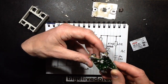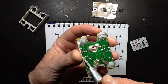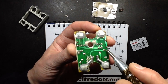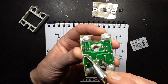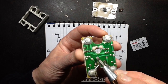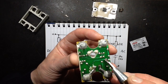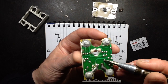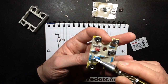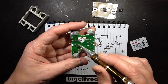Isolation on this board is not really great. There's silly things like — this is the isolation track here — it's just that wee bit thinner than it could have been. Here's the back of the opto-isolator and there's a track defeating the isolation distance a wee bit, and it's not needed because both those are commoned up there. They could have just done away with this section of track and it would have increased that space considerably. Likewise, with this resistor being moved just back a tiny wee bit, the clearance could have been doubled with a little bit more design effort.